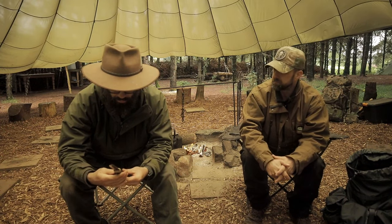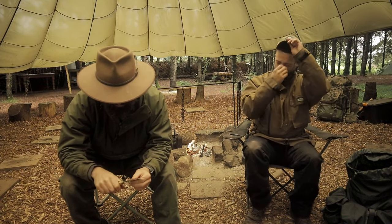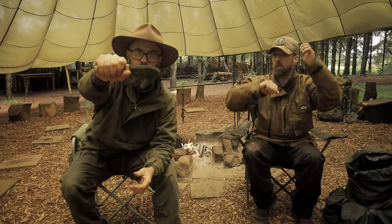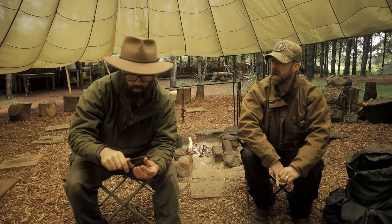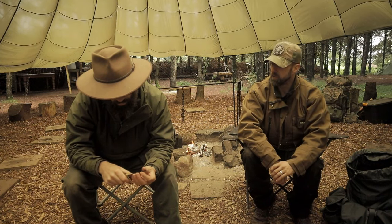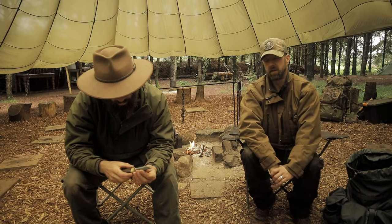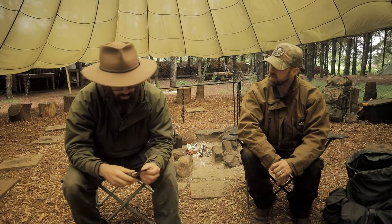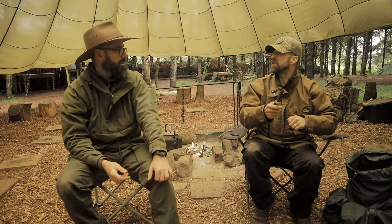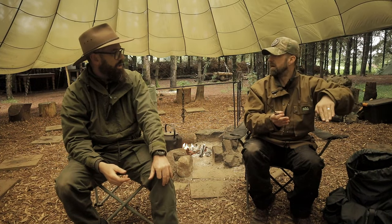Yeah, and I left all the forge marks in. What happened was I took it home, and we did so much yapping that we never put an edge on it. When I took it home, I took it to the stones and I sharpened it up, and then I went off to England and I used that knife on my course. But I hadn't tested the edge, and the edge was like a big fat convex thing. So it wouldn't shave anything. It was like skipping across. You weren't getting the angle.